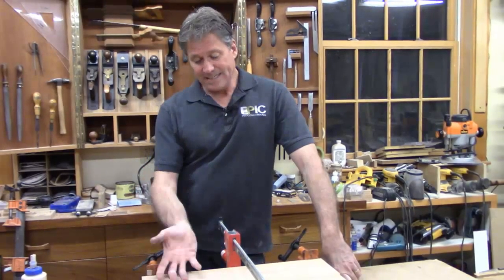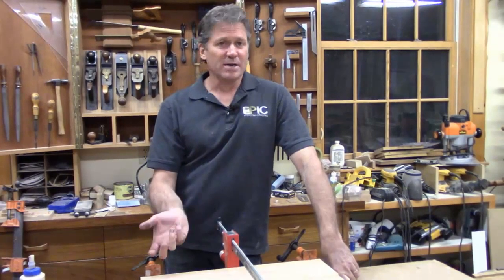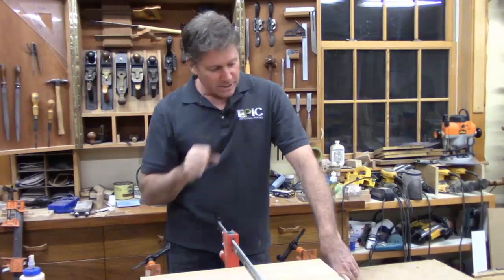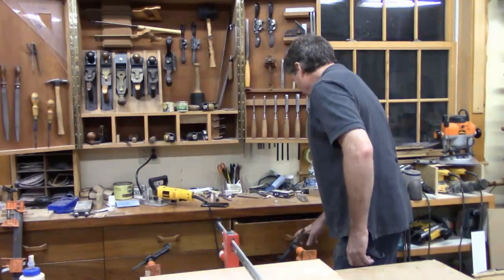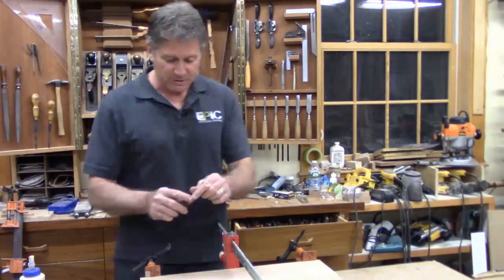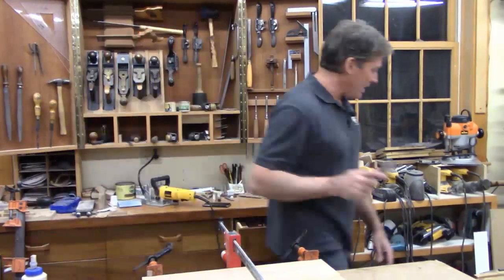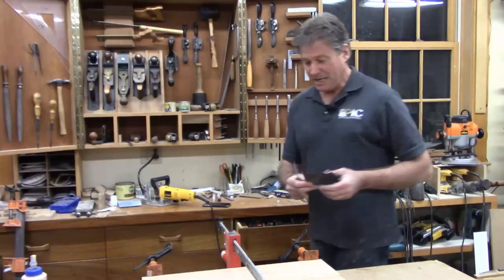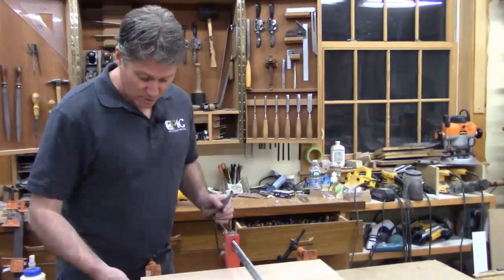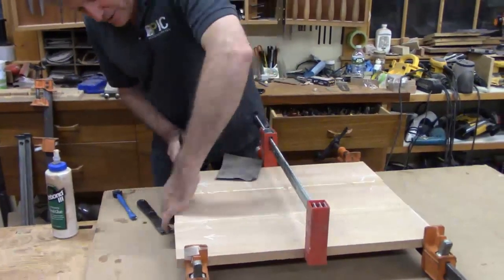Now, you can let it stay on there for a little while, and it will start to get a little rubbery if you catch it, in about 10 minutes, 15, maybe 20, depending how warm it is. And it's easier to peel off. I just like to use a little putty knife, a nice flexible one. You can come along and peel it off. Now, in this case, we're not going to wait. Sometimes if you wait, you get involved in something, you forget, and then you have to clean it off the old paint scraper way, which has its limitations.